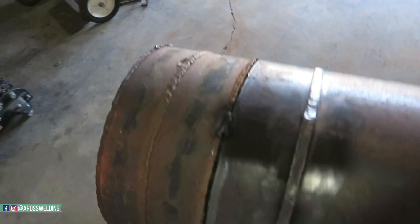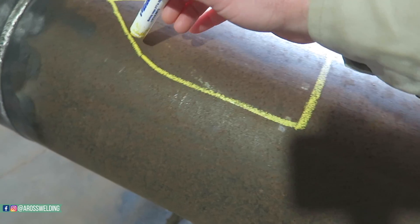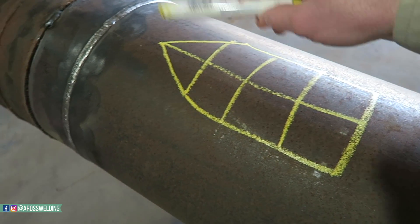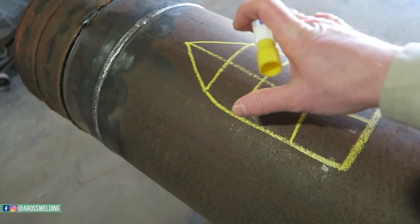Now let's get into showing you how to make a stencil. This is especially helpful for helpers. On a fabrication job, you will write the stencil — write who made the weld — and you want to transfer the heat numbers from the pipe you cut your pup off of onto the pup. I don't have heat numbers here, but I do have a weld that I've made and I'll show you how to stencil it. Depending on whether you're on fabrication or mainline, it will depend on whether you need this whole layout. This is like a mainline situation — you've got your bead, hot pass, and then depending on the thickness of the pipe, your fill and cap on the firing line.